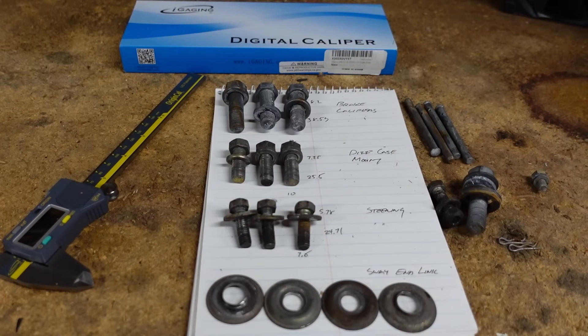First I take an inventory of all the pieces so I know which one is which. Now we're going to have to do some math. We want about 0.1 amps per square inch of item — the voltage is less important. Fortunately, Caswell has an online surface area calculation tool. I'll put a link to the calculator in the description below.